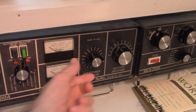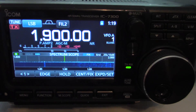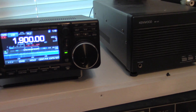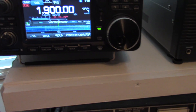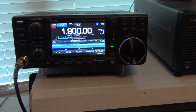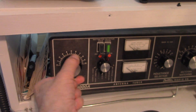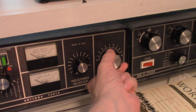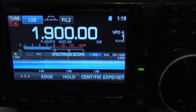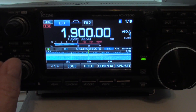I have an old tuner, as you can see, and I'm up here in the daytime on 160 meters, so there's nothing going on. What I try to listen for is mostly static. Now I tune for peak noise — if you watch the S meter, I'm tuning at peak noise, and usually that's pretty close to the low SWR.